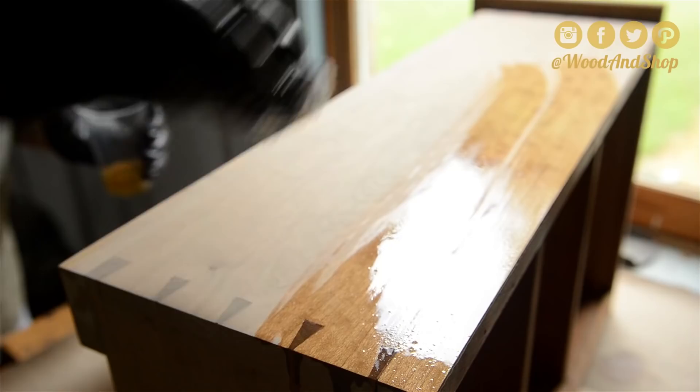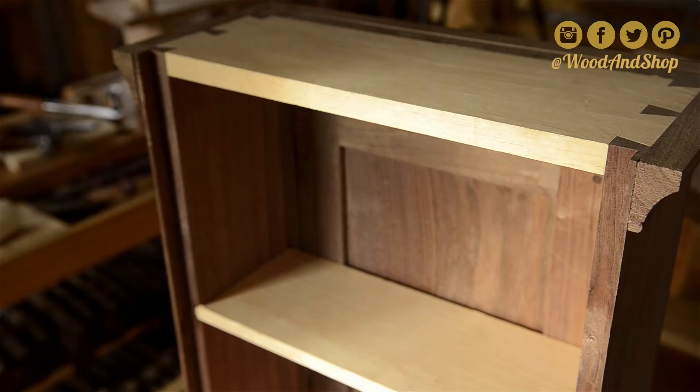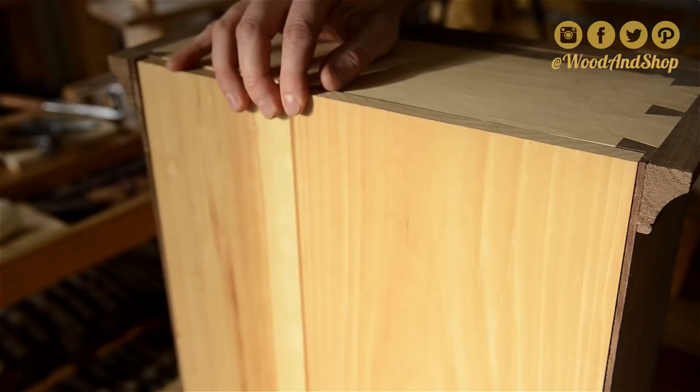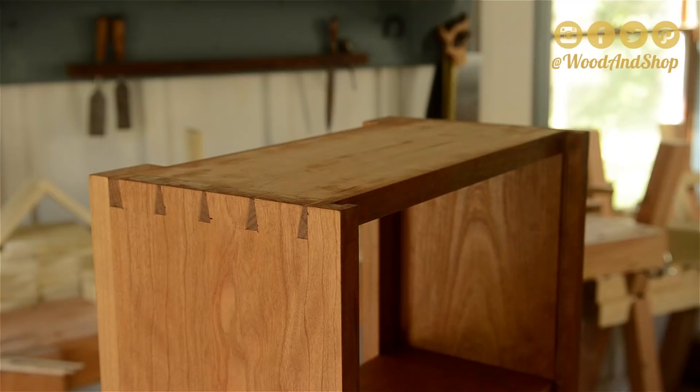I pre-finished the back because I'm going to put it in now. You can see it slides right into that groove and bottoms out. I also have a nice little Shaker handle at the top. Here's an illustration of the other type of backs you find on cupboards — here's a spice cupboard I made with a shiplap back. It allows the back to move, but it just sits into a rabbet and then you nail it into the case. So that's how some other styles work.